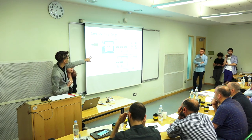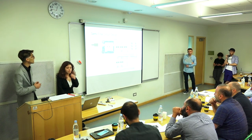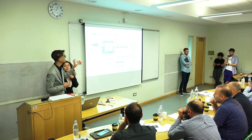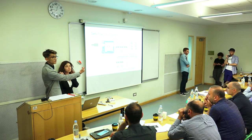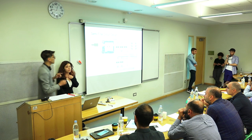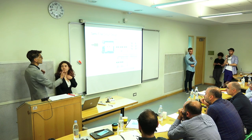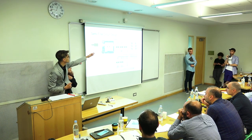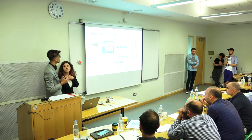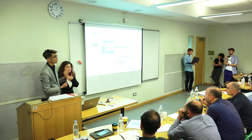We have two shift registers, and as you can see, one of the shift registers we call the inverse shift register. Why is that? First of all, whenever we're putting in data, if we put a 1 bit into the shift register, then the inverse will give a 0. With this combination of 1 and 0, if we feed it into the H-bridge, we can control the direction. In this case, a 1 and a 0 would push it upwards, which we identified as the red LED. The LEDs are a stand-in for the coils. And of course, vice versa: if you put a 0 and a 1, then it will pull it down.